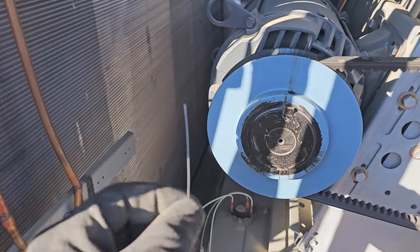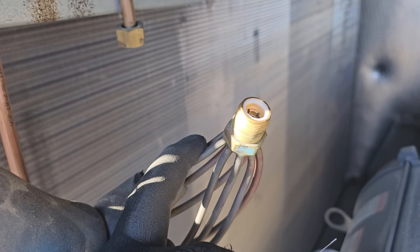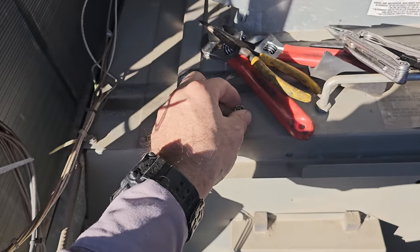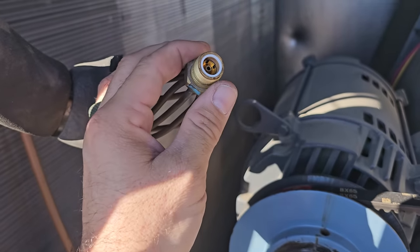So we're gonna grab this little guy right here, get in there. It's a little piano wire thing. We'll pull it out and slap the new one in, then put the new Teflon ring in there too. Pulled the old piston out. Nothing too crazy, just a little dirty. But again, it's cheap insurance on something like this.